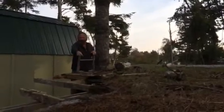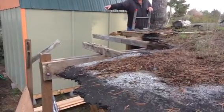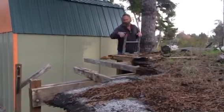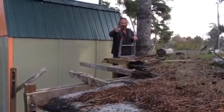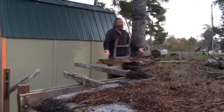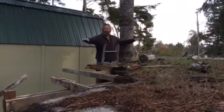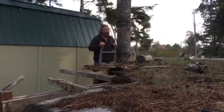We've got some rotting material here. Some of the framing members are in pretty poor shape. The main frame structure, the poles, the main set of beams, and a lot of the 2x4 framing is in pretty good shape. Some of it's not. This one is obviously pretty well had it. So we're going to be replacing the parts that need to be replaced. We're lifting this entire deck off and getting rid of it, putting down a new deck, new tar paper, and new metal roofing that should last this thing the next 50 years and beyond.